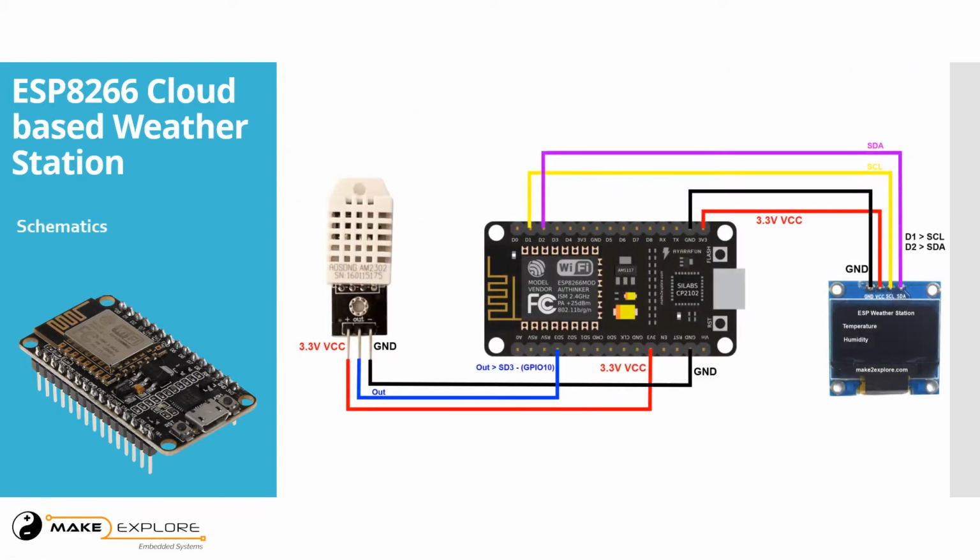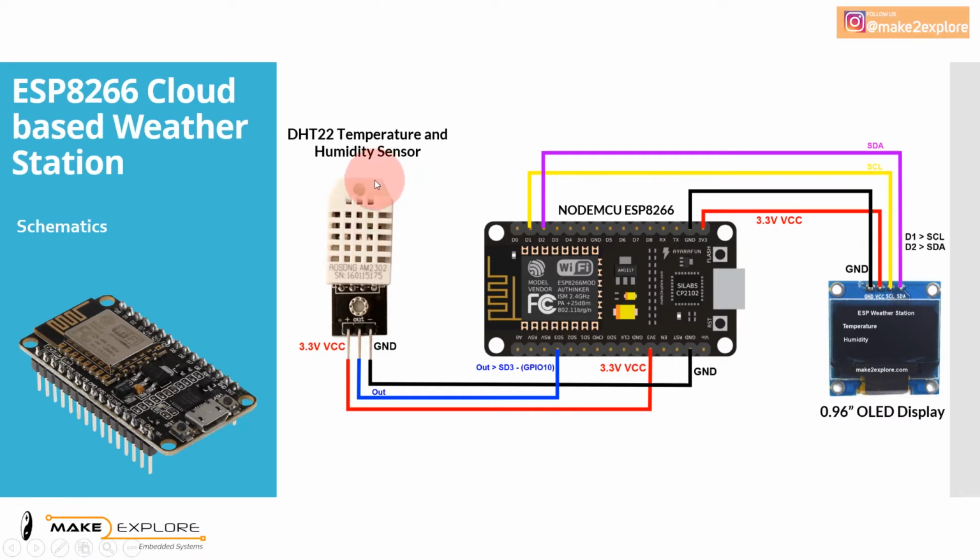Now let's see the schematics of this project. We will be using a DHT22 temperature and humidity sensor, and a NodeMCU ESP8266 development board. To measure the DHT22 temperature and humidity sensor readings locally, we have connected a 0.96 inch OLED display, which is connected using the I2C protocol. You can see the SDA and SCL lines here. So this is the schematic of this project. We will post the schematics on our GitHub page and share the link in the description of this video.